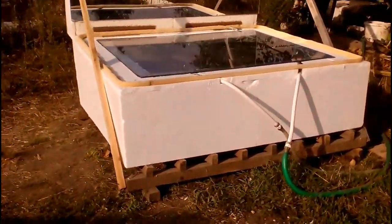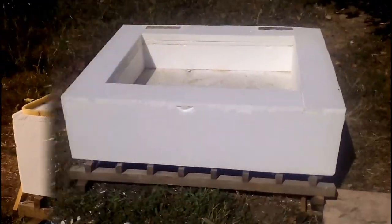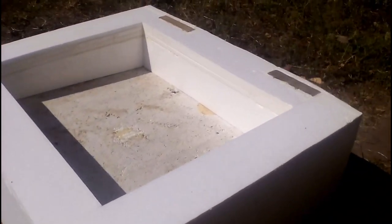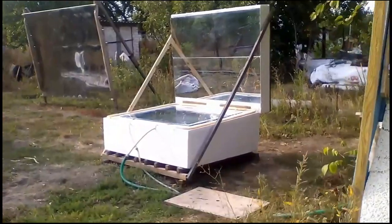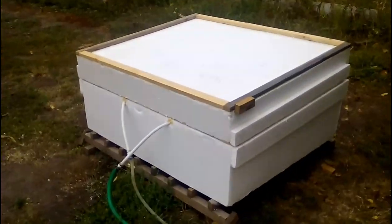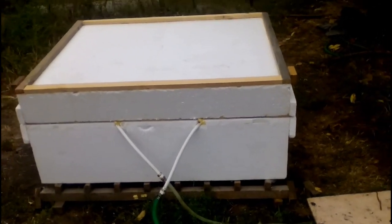This is because 100 liters of hot water are located here under several layers of glass and transparent plastic sheets, inside this box of thermal insulation with a thickness of 16 cm. That is why the hot water almost does not lose its heat at night, and I can close it with this cover, which helps to better keep the temperature of the water during the night or a few cloudy days.